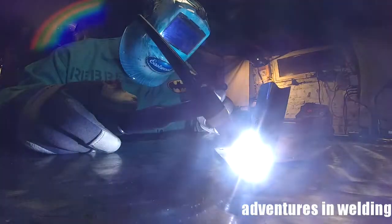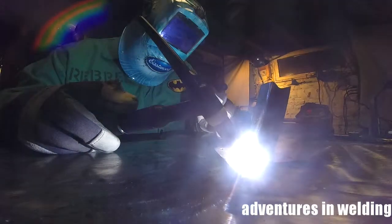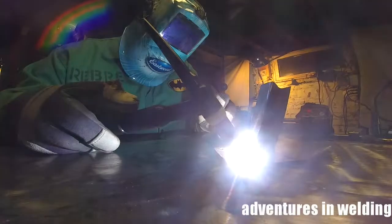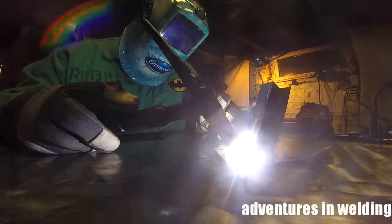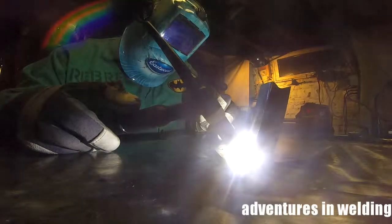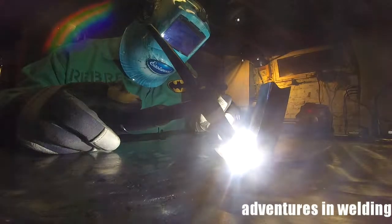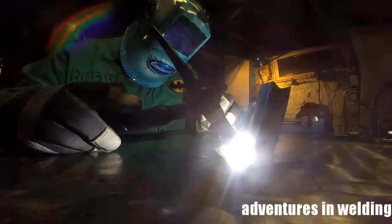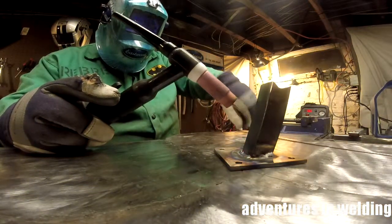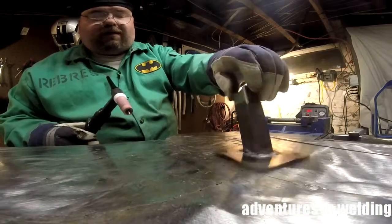I want you to see, I mean, the whole basis of my channel is that I am a welding student, and I'm sharing with you what I've learned as I learn it. One of the first things Gary Coulter, my TIG instructor, told me was, if you're not happy with the way the weld looks, before you gouge it out or grind it out, try just washing over it again and smoothing it out. I do that a fair amount to make things look nice. Try not to have any gorilla welds.